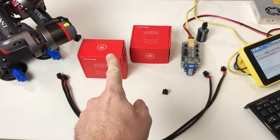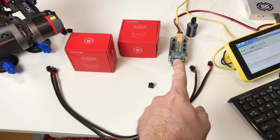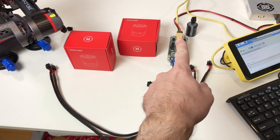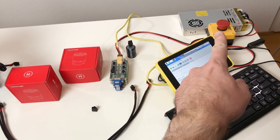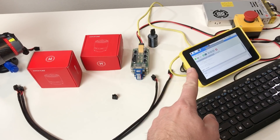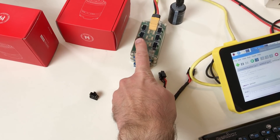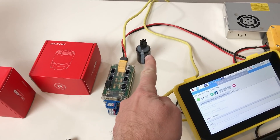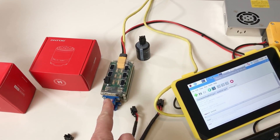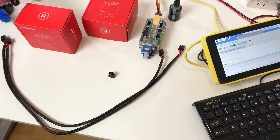So here are the things I will use today: the actuators, the electronic board which converts the CAN bus to Ethernet. This electronic box is connected to the 42 volt power supply through this switch, and with the yellow cable it's connected via Ethernet to the Raspberry Pi. In the electronic box I already have the termination connector — a 120 ohm termination resistor — and this is the capacitor which comes with this electronic board. Also the cables and another termination resistor for the actuator.